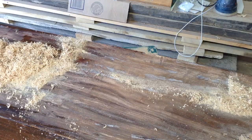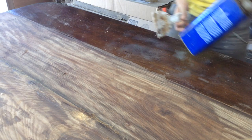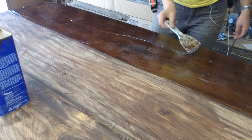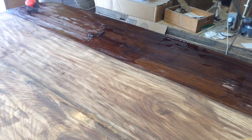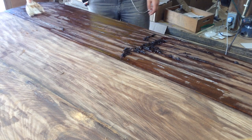After that first scraping it really goes through and removes a lot more stuff, and the varnish gets absorbed into the sawdust so you don't have to worry about wiping it up. This is a 15-minute stripper and it was quite warm this week - in the 90s and extremely humid - so the stripper was evaporating a little bit before it was time to scrape. This project probably would have gone faster if it wasn't so warm out. First coat takes off all that finish, then I scrape it into a bucket and do the second coat.